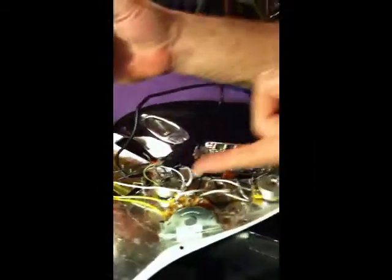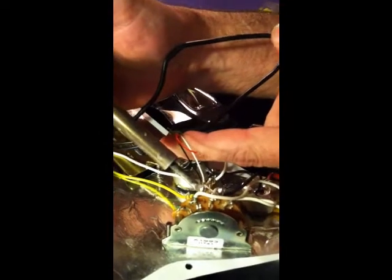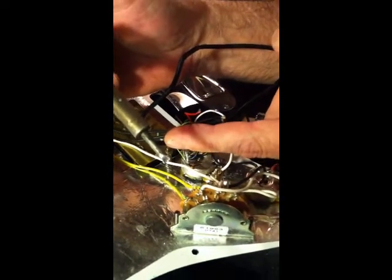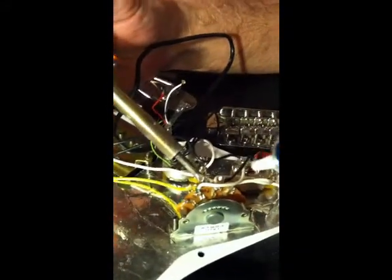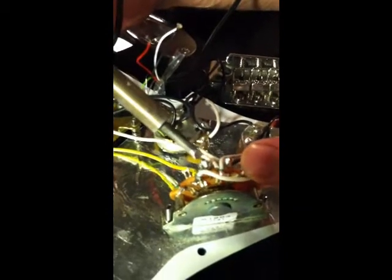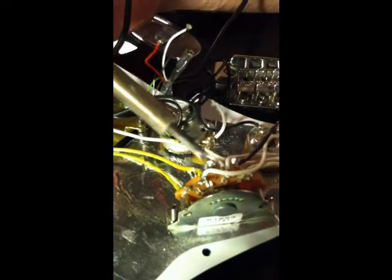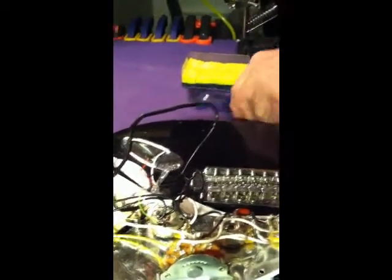So again, we're going to go back in here, try to get my hands out of the way. We've got a black and white wire here. Again, we're just touching it. You're heating the metal, and it just released, just like that. That easy. Go back with the solder sucker. Heat it again until it flows. You see the color change? You'll notice, see how it's kind of a hazy color now? And when I get it melted, it's a shiny color. And you'll notice every time I do any maneuver, I go back and clean the soldering tip. So those two are out.